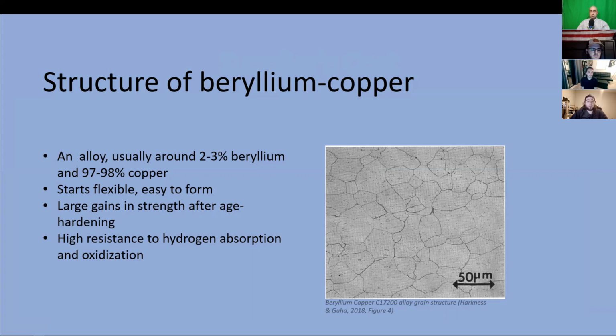One thing to be careful of when working with beryllium copper is that the alloy should be kept away from chemical compounds such as polyvinyl chloride or vulcanized silicone while they are being cured. The fumes given off can corrode the beryllium copper. Beryllium copper is only toxic if inhaled in the form of dust, mist, or fume. Inhaling beryllium can cause chronic beryllium disease, which is a lung condition that blocks the exchange of oxygen.